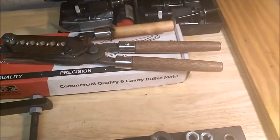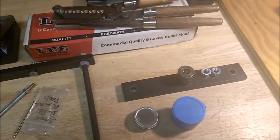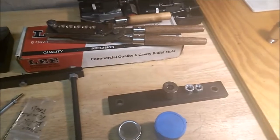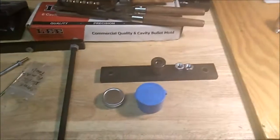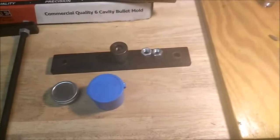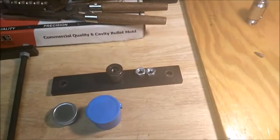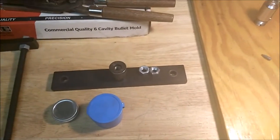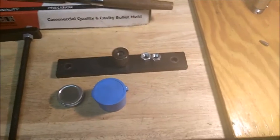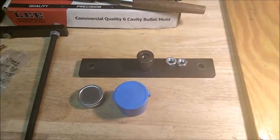It's when the nose either splits lengthwise a little bit, or you're ejecting and sometimes you've got to adjust it just right, or something in the pin penetrates past the nose down into the lead, and it sticks on the pin, and those you pretty much got trash. It's like a real hollow point, but damaged. Or sometimes the very tip of the base, when you're seating the core, will actually flip open, almost like a pop top, and those are trash. If you got it way out of adjustment, they're no good, but for the most part, probably 80% are salvageable, if not more.